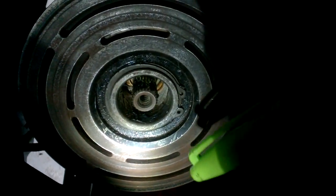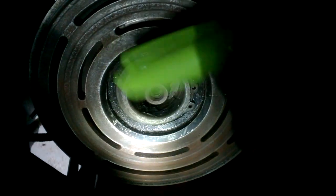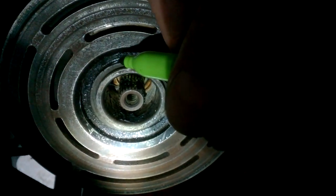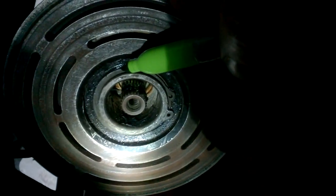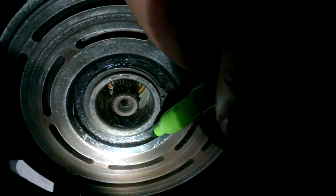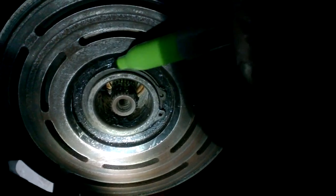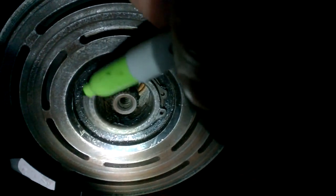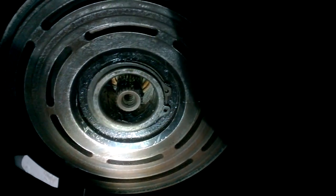What I actually did — because I didn't have a bearing and didn't want to mess with removing the whole pulley and getting a puller — I just removed this cover. You get a small screwdriver, the ones used to repair tiny watches, a flat screwdriver, and can pop up the black cover after you remove the circlip. Then you can pop up the cover and clean inside the bearing — the races and balls — really well, then just pack it with grease, pushing the grease inside with something, then put the cover back and the circlip back.